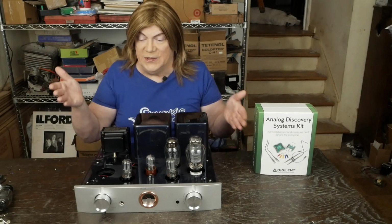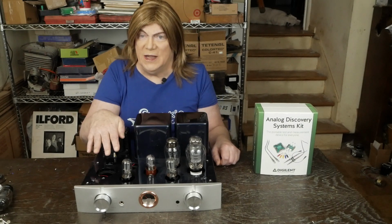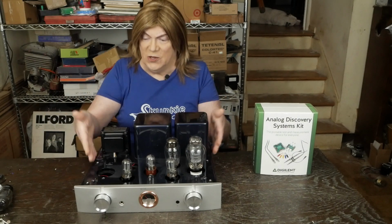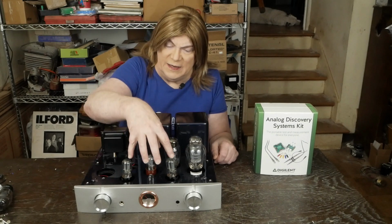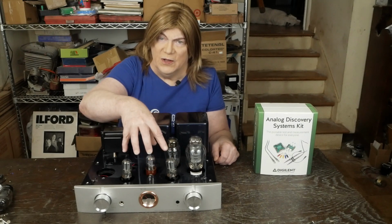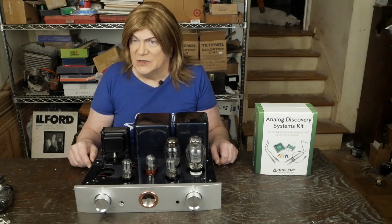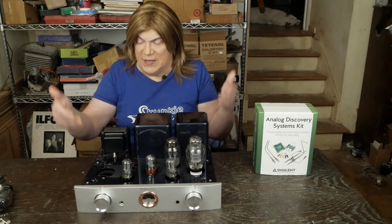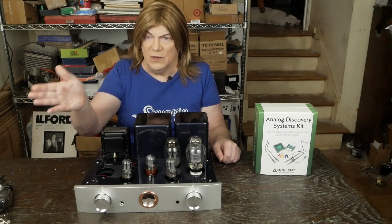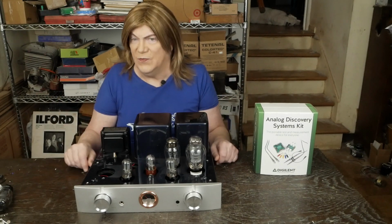But anyway, if you got one of these earlier versions, after you fix the power supply, a pair of these Hashimoto output transformers are going to fix the other problem that I saw with this amp, but it's still going to have this, what I'm calling a weak front end that is just not capable of driving a 300B tube to full power without clipping. So you have to live with that. And Woody, the guy that owns this one, he's got some Klipsch Forte speakers. He's probably going to be using the 1 to 3 watt range, and have a little bit of headroom there. And this is probably going to work fine for him.